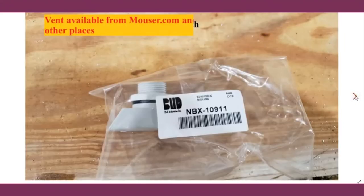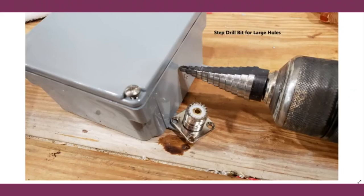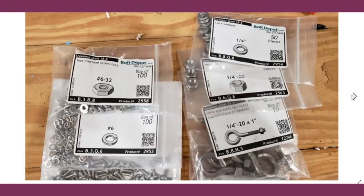The enclosure box gets a vent drilled into it. We drill the hole for the coax jack using a step drill, which you can get at any hardware store. The coax jack mounts on the inside, poking through with four mounting holes. All hardware is stainless steel — sourced from boltdepot.com — so it doesn't rust. A 10-24 bolt is used as the stud for the ground and antenna jack connections. Hex-head screws are preferred over Phillips because you can use wrenches to get them much tighter.